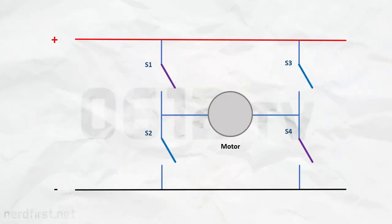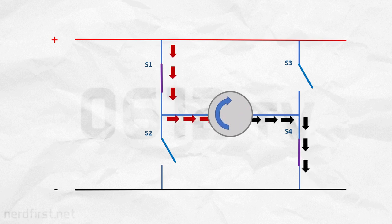But that's not the ingenious and cool part — it's the solution for problem number two that's really cool. With this setup, we can easily drive the motor in either direction. Watch what happens when I close these two switches. There is now a closed circuit from plus, going down, and in the diagram going from left to right across the motor, going back to ground. This drives the motor to run in one direction.